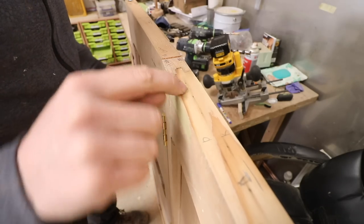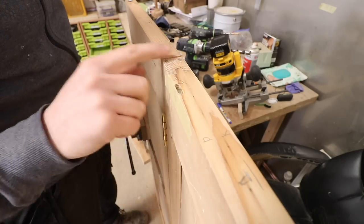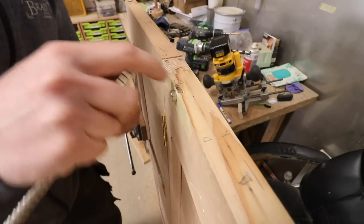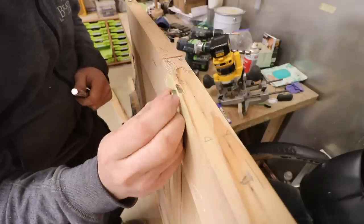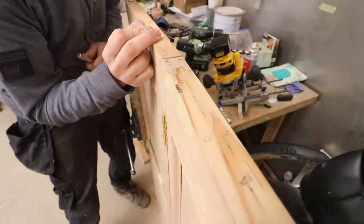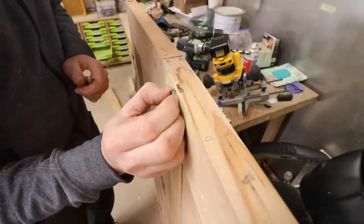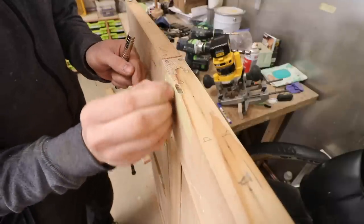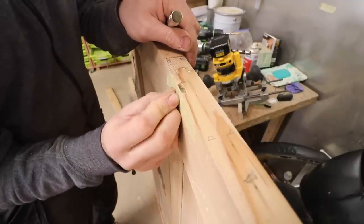And then once you got to that stage, I use two-pack filler and just completely fill either side of the magnet and all over the top and just sand that flush. Like I was saying earlier, this magnet here wants to then attract to the one that sits over here, so I'll take that magnet that's set there and I'll twist it round, so when it's in this position they magnetise together, and then I need to just check when I'm putting the ones in the frame on the doorstop that they do attract to each other. Because if you set that magnet the wrong way round, it actually works as a push, so you can't get them to sit in line with each other because of the polarity of the magnet.